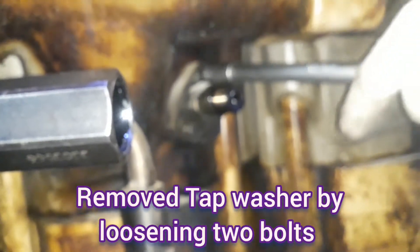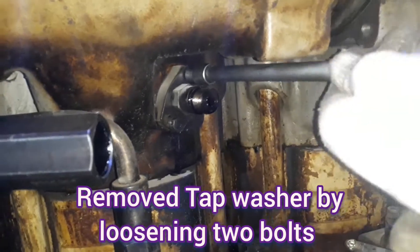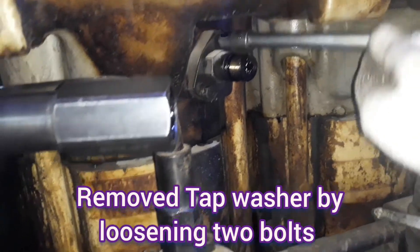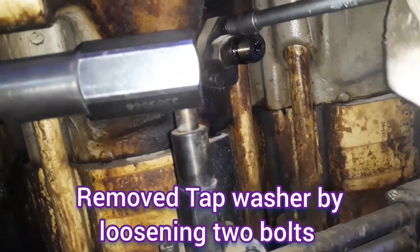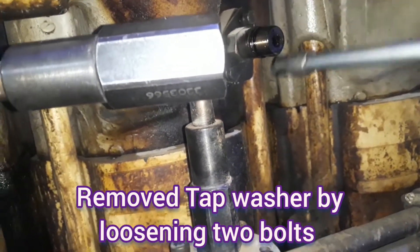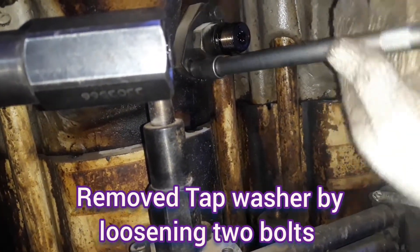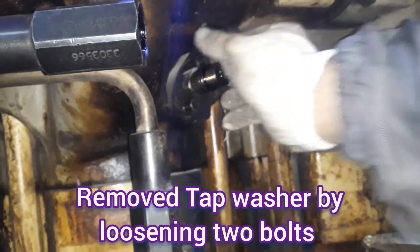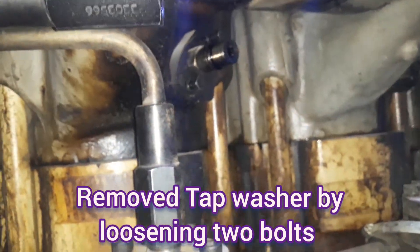We will see that we have removed the fuel injection pipeline — the high pressure line removed from engine 9L-2131S. Then we are loosening the connection and loosening the bolts for the tap washer. After removing the tap washer, we will remove the connection pipe.